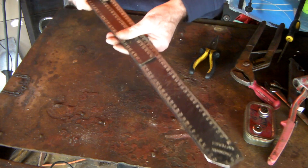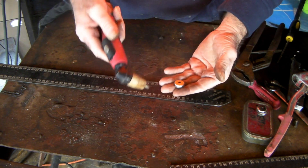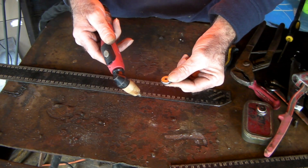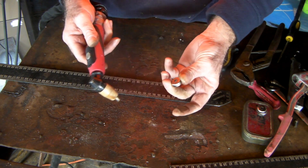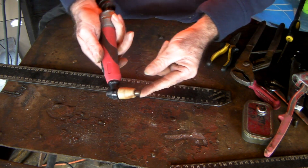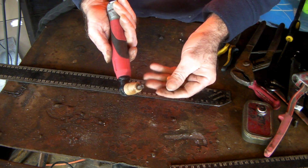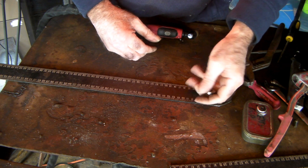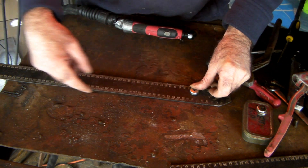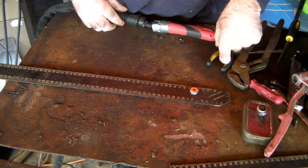Let's see what we come up with. You might have seen the last video where I was using these to try and cut circles — that was a bit of a disaster, you should go watch that and have a giggle. What I learned — and you guys taught me too — is that the magnetic forces from these earth magnets and the plasma cutter tip don't really mix, because it tends to pull the arc of the plasma cutter to one side and virtually ruins your tip straight away. So my theory was: if I had a wider piece of plate with the magnets in the middle, keeping a fair distance from where I'm cutting, and I used the torch to space it out again, it might work.